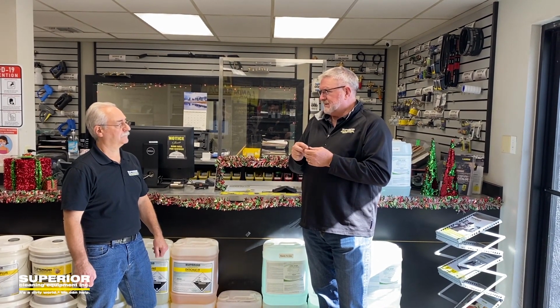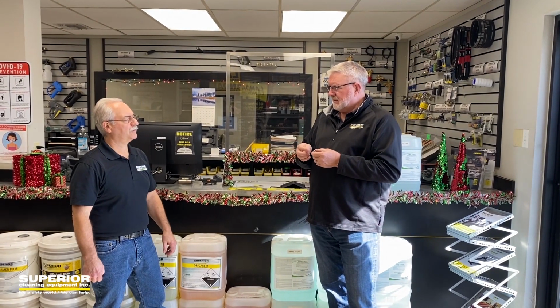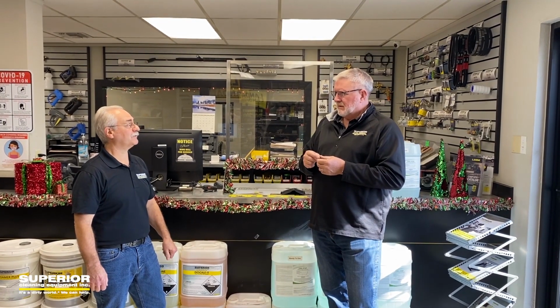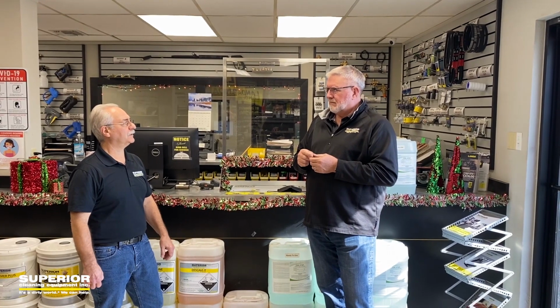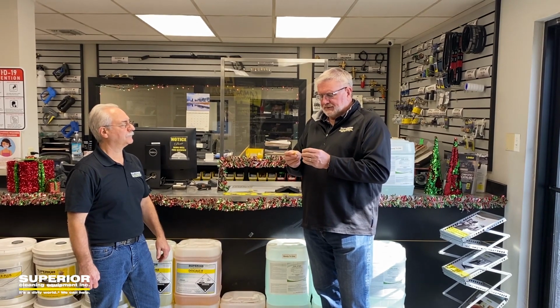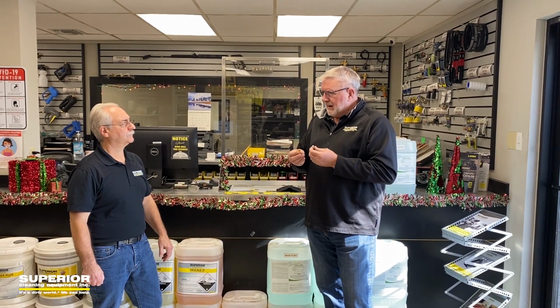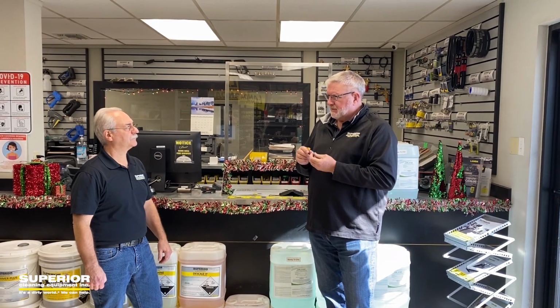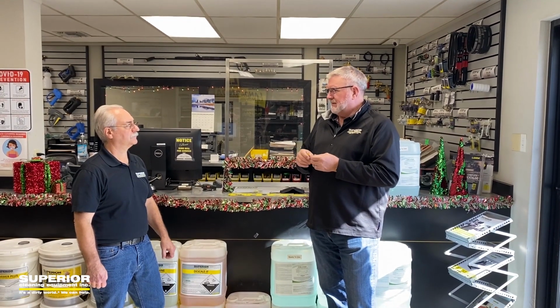Does the orifice size number, the 040, 055, 060, usually correspond to the gallons per minute of the machine, or not? It usually does, but like I was saying before, with the experiments, sometimes they try to get more pressure out of a smaller one without overloading your motor. Okay, good. So people come in and want to buy a nozzle, or they're looking online to get the right nozzle to have the optimum pressure and gallons per minute for their pressure washer. They need to make sure these numbers match what they're ordering on the orifice size and then the spray pattern they want, right?